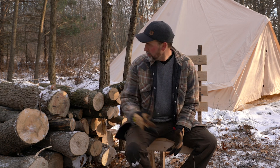So if they get some trees that they don't deem worthy of firewood, basically around here it's poplars and what you might call cottonwoods or quaking aspens, depending where you're from, or junk maple is what they call them. Instead of splitting them up and cutting them into pieces, I've offered to come get them from the sites, and I've made a few trips with my pickup truck, cut them into manageable pieces, which are these, dragged them out here, and now I'm going to have to debark them, go through them, find what sections are nice and appropriate for the cordwood. My walls are going to be 8 inches wide, so I can get quite a few pieces from these sections here.